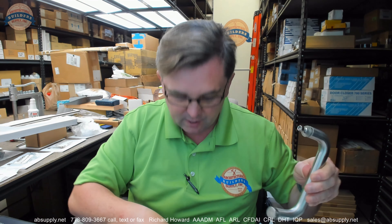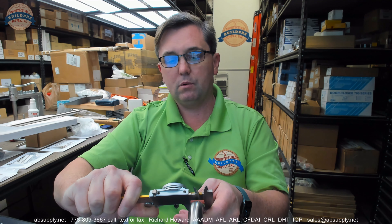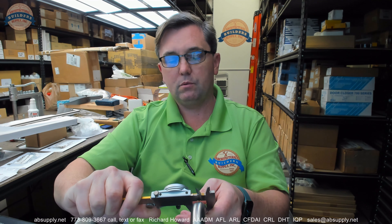Their material is tubular, meaning it's a hollow tube of either stainless steel or brass. Being tubular certainly contributes to it being more economical rather than being a solid piece of material. This is stainless steel but just a hollow tube — not solid stainless. We can supply solid stainless or any architectural metal: brass, bronze, Type 316 stainless, or aluminum if you want aluminum base material.